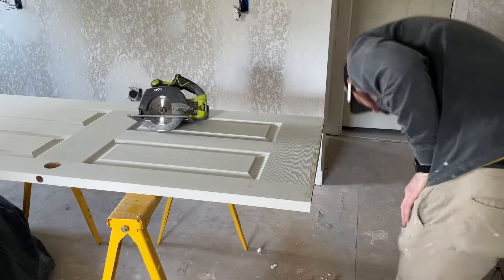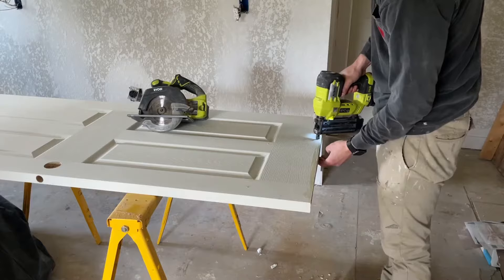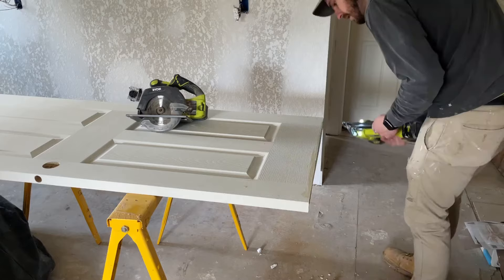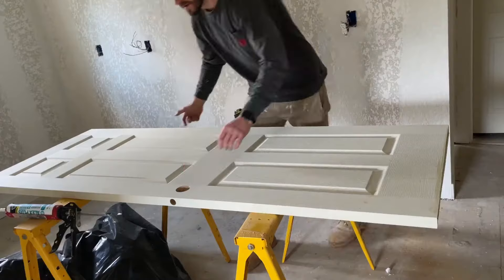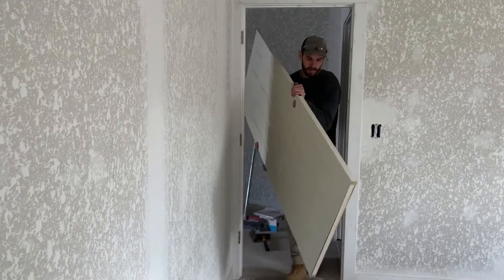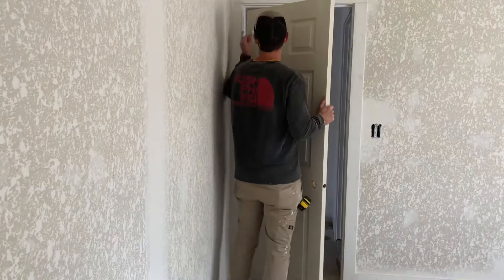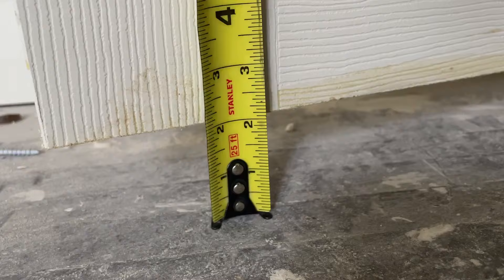Since I don't have clamps, I'm just going to take a nail gun and drive a couple nails into it on each side. If I did my job right, the door should be hovering two inches above the ground — let's find out. Very nice! Another thing you're going to want to do is shoot some caulk in those nail holes if you're doing it the same way I did, but if you're using clamps you don't have to worry about that. I'm going to leave it at that. If you enjoyed this video and want to see more, make sure you hit subscribe and like this video. Leave a comment down below, let me know what you're working on, and we'll catch you in the next one.